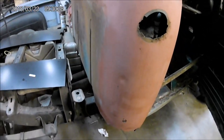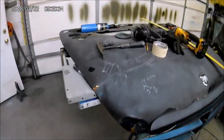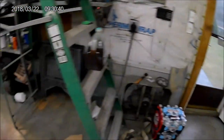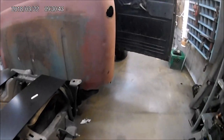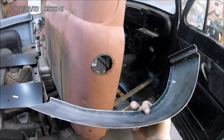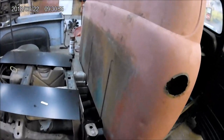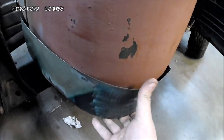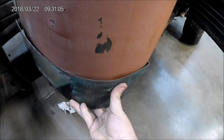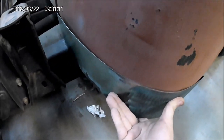This is going to be a little bit difficult to show. First of all, let me show you — what I did was take all the measurements off the one we had gotten, to make it a little bit easier, but those measurements could easily have been taken off the body. You can see how it's made down at the bottom — it's not perfectly followed at the top but that's no big deal. With a little bit of force to get it to sit where it needs to be, you can force it around and bend it in — it made a very, very good patch panel.